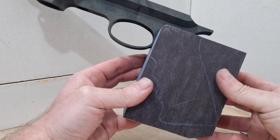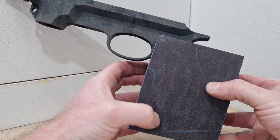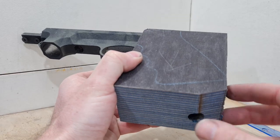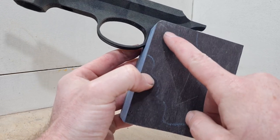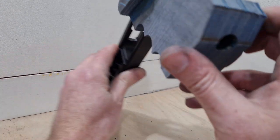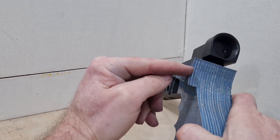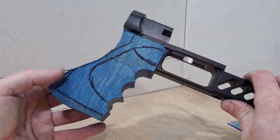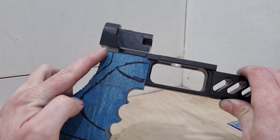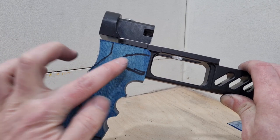Next thing to do is decide about trimming off the excess wood. I'm going to bring a bit of this rake out and stand the whole grip a little more upright — when you do that, just be mindful of where your fixing bolt hole is. This whole side I'm going to rip off anyway and leave a little thumb shelf on the side. I've just drilled some holes through to start establishing some finger grooves, ripped it down to just under 40mm wide. I've left a bit of a step that'll end up shaped into a thumb shelf, and I've got reference marks for bringing in a little palm swell, little trigger lead-in, and then I'll start rounding back these edges.